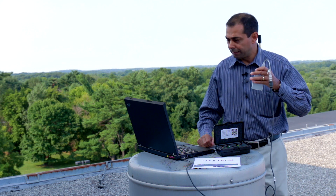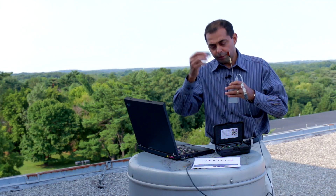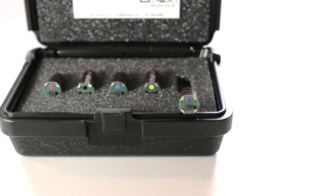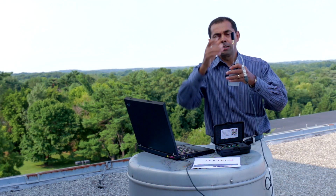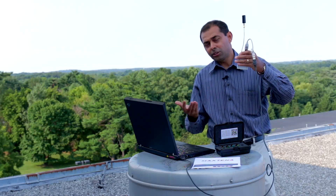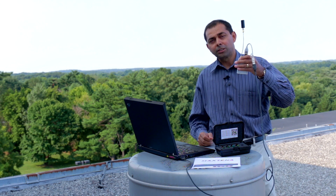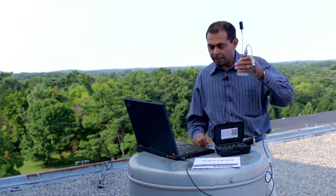You will have just seen a close-up screenshot of how many satellites were being tracked and the carrier-to-noise levels with the blue antenna. I'm going to remove my artificial loading, unplug it, and plug in the purple, which is the highest frequency in the kit. When doing this, make sure your antenna has a clear view of the sky. These helix antennas are ground-plane independent, so holding it shouldn't affect performance. Again, this is a test environment — you should test in your own setup that best simulates the customer use model for your device. Check the screen to see how many satellites can be tracked.